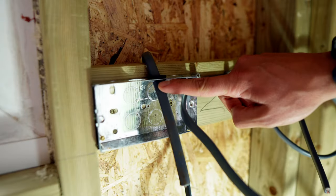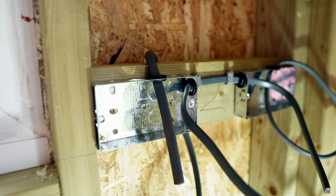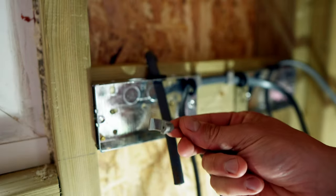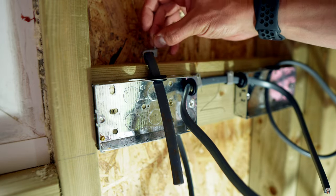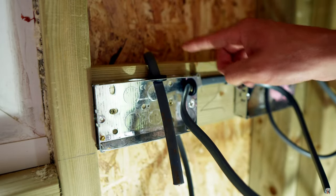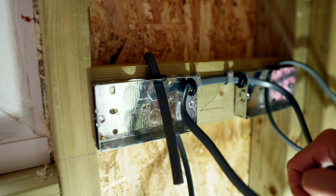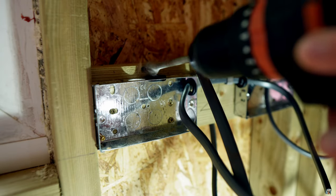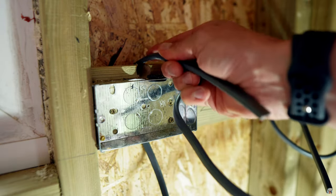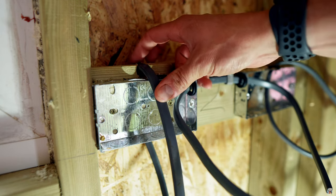I've now pulled this cable through and pushed it through the grommet. Most people would grab a cable clip, put it over the top and hammer it in — however, I would rather have a totally flat surface so that when it comes to putting the insulation board in I don't have to notch anything out. So I'm grabbing a 19mm drill bit and drilling out the top piece of wood, which creates a lovely gap for the cable to sit in and be tucked in flush.